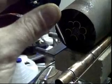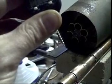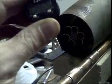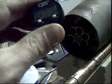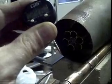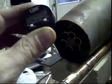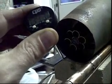This cone is from a gas dryer — any gas dryer has this cone shape in the bottom left corner where the gas flame shoots in to direct heat into the drum to dry clothes. I removed that cone, which has a thermostat on the side that kicks off if it gets too hot — you could wire that into your circuit to shut off the torch. I've taken copper tubes with the center tube filled with stainless steel so the torch interacts with the stainless and distributes heat to the copper, with a simple house fan on the back.